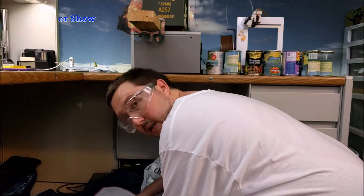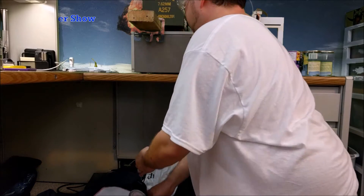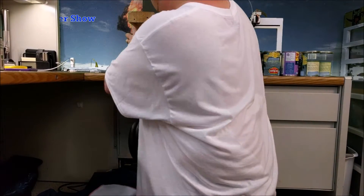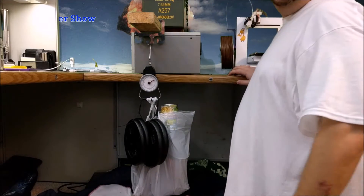It turns out that even without infill, PLA is way stronger than people give it credit for. Even without the enhanced PLAs, these bag hangers are holding so much more weight than I thought they would. I thought just throwing some cans in a grocery bag would be enough to break it. So I've got 40 pounds hanging on this scale — now 55 pounds.